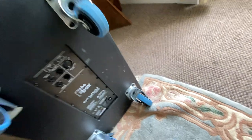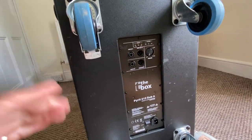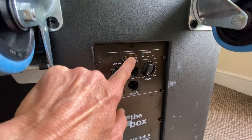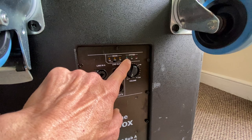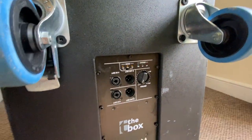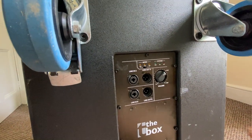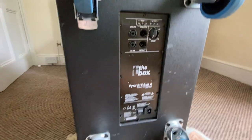These are absolutely idiot-proof. You have a mode switch for 10, 12, and 15 — very simple: if you've got 10-inch mid-tops you set it there, middle for 12, across for 15. There's an indicator that comes on when the power's on, and another that lights up when you've got signal running through. That's your clip indicator — as soon as it goes red, you're clipping. During my event Saturday night I was ramming these and it never clipped. You can set the gain to 0 dB or turn it up slightly; I generally go around three o'clock.